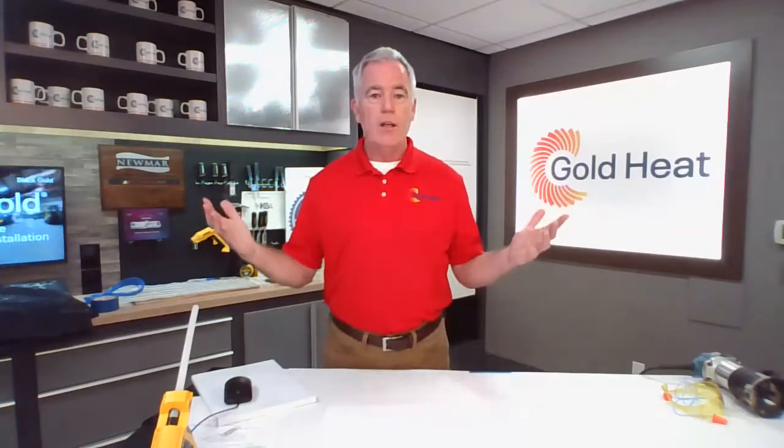Hardwood flooring. Who doesn't like hardwood flooring, right? So there's a lot of different kinds of hardwood. 3/4 inch solid hardwood has been pervasive for years, especially where I am in the Northwest because we have a lot of raised subfloors. But it really is not a good product to put in an environment where you're going to subject it to a lot of stress.